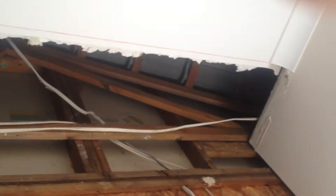We've pulled this section of ceiling out in this alcove — we wanted to have a look and see what had actually gone wrong up there. We found that the trusses are twisted and warped a bit and there's no nogging or trimmers inside there. So we're going to put a row of trimmers in the ceiling here. You can see where it goes right through — there's a bit of a bow in there. So we're going to fix all that up, straighten it all out and then sheet it again.